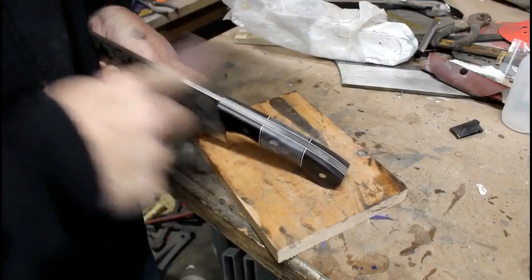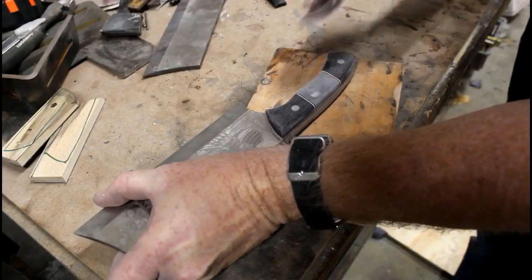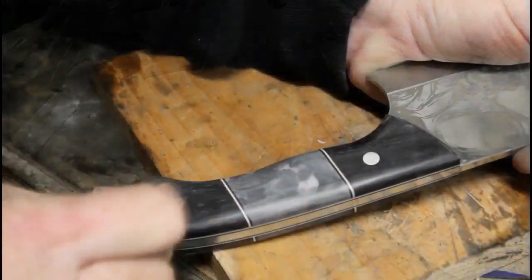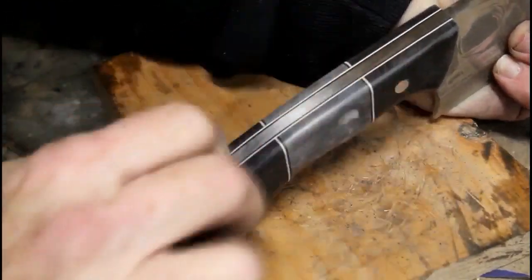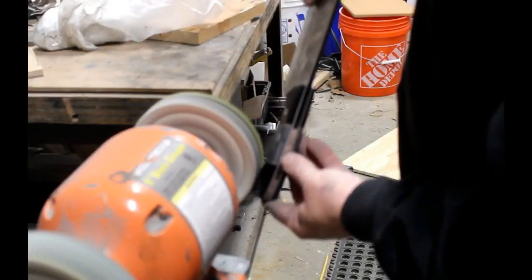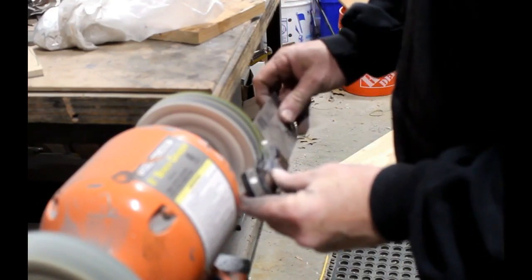The whole shaping process really doesn't take all that long. I then do some sanding with an oscillating sander going 400, 600, then 1000 grit, followed by hand sanding. You really do get the best finish on most knives by adding hand sanding at the end — your fingers just mold to the curvature of the handles. Especially working with paper micarta, you've got to hand sand it down to at least 1000 before polishing. I never like to spray my handles; I prefer to polish them — I'm always afraid spray would yellow. So I went to the buffing wheel with a little buffing compound, and on the finished product I use a little automotive car wax that I rub on and polish off.